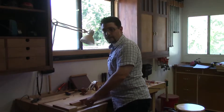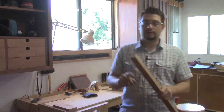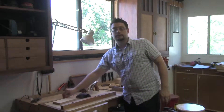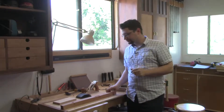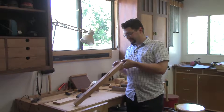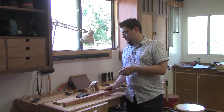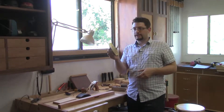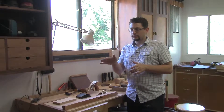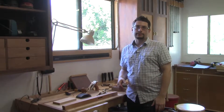Here I've got to make sure I stay away from the mortise for the lower rail — I don't want to get close to that when I'm sanding. The next thing I want to do while I have the front leg here is to round over the edges. For a lot of the chair we'll use a router with a round-over bit, but because of the way the ankles are here, I can't just run a router bit. So instead I'm going to grab a block plane set on a very fine cut and start cutting chamfers — first at 45 degrees, then at about 25 degrees on each side, creating a three-faceted surface, and then with a little sandpaper I'll round that over.